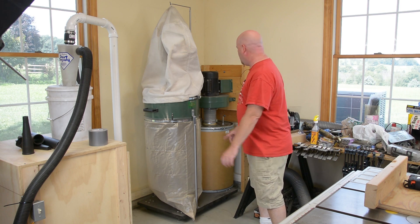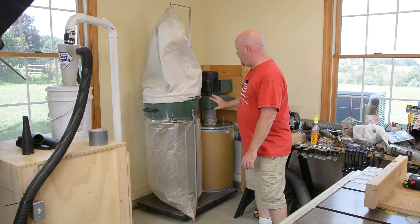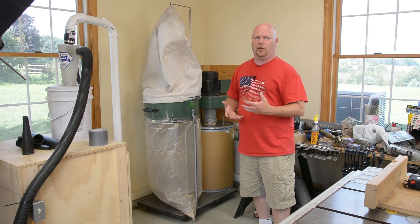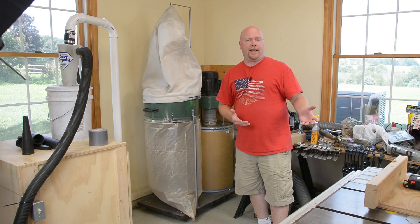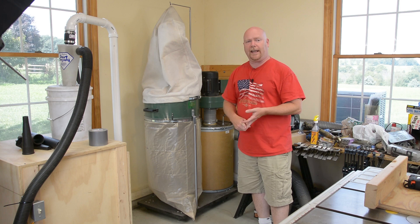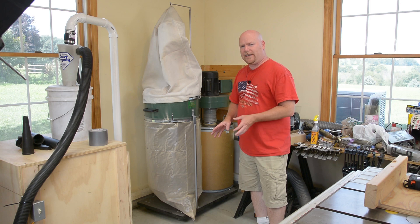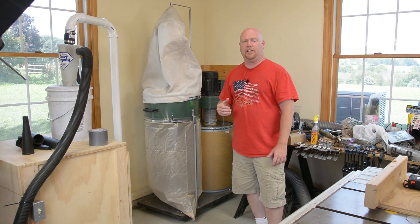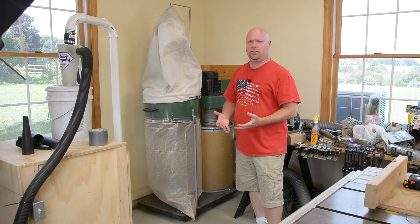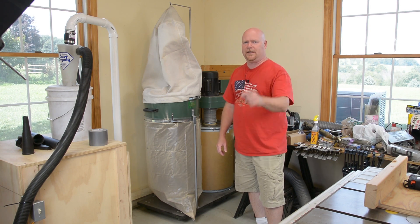Overall, I'm really happy with the system. The separator works better than I ever could have imagined, and even with the bag and the separator in place on only a 15-amp outlet, I get enough airflow to get good collection from the tools I have it hooked up to. I have short runs, I use all 4-inch hose, and I only have it connected to one thing at a time — all of which works in my favor. When it's all said and done, while the whole thing is certainly not perfect, it is orders of magnitude better than not having any dust collection. I'm sure we can make it even better, but that's going to have to wait for another day. Till then, stay safe YouTube.